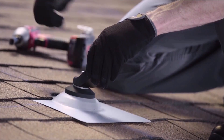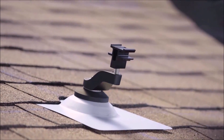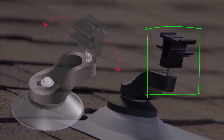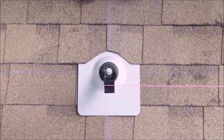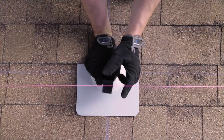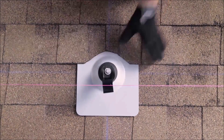To get the flashing installed, begin to insert and install the first row of mounts. At each end of the first row, measure and adjust the mounting assemblies to the same height. The mounting assemblies swivel to increase or decrease the height. Then, tie a string at both ends to bring the mounting assemblies to the same height across the entire row. Mounting assemblies for subsequent rows should also be at the same height as you insert them into the frames of modules you are installing.